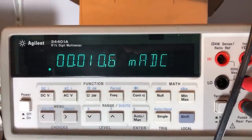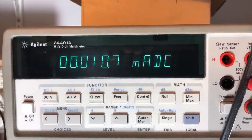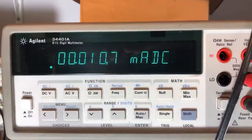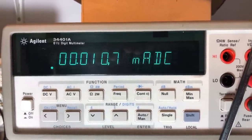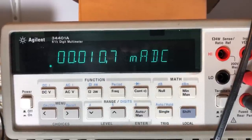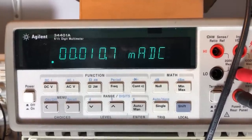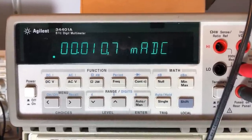As I'm looking at the screen of the bench multimeter, the sensor is only pulling about 10 microamps, which is great. I'm definitely going to use these sensors — 10 microamps is perfect for a battery-powered sensor node. Now all that remains to be seen is how good these are overall at detecting movement.